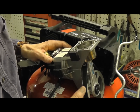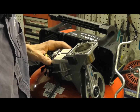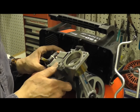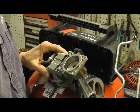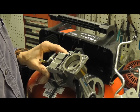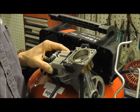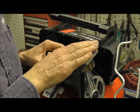There is nothing to keep that from happening. There really is no air filter assembly on this. If it does have an air filter assembly, it's certainly not on the head of the unit. It looks like it just simply draws air in from the side and compresses it — so you're looking at non-filtered air. If this is running in a dusty or sandy environment, it's going to wear this thing out in a heartbeat. This is $99. You get what you pay for.